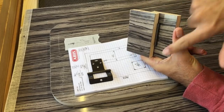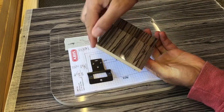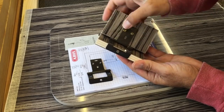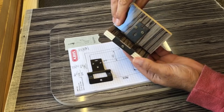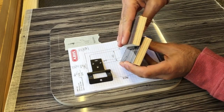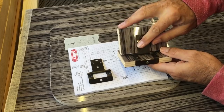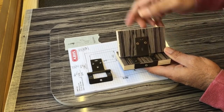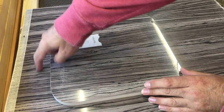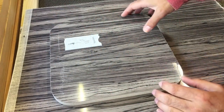From the outside, all you'll see is just this part of the hinge, so it's fairly discreet. When the doors open you'll see the rest of the hinge. I'll need to find small screws that recess right into these countersinks, because if the screw heads are proud there's a possibility the door could be hinge-bound and might not close fully. I'll put a link in the description below to where I got these hinges from. Let's get some masking tape on this board, match up the grain pattern, give ourselves an additional 20mm all the way around, cut the new door out, then router the slot, put the trim on, and attach those hinges.